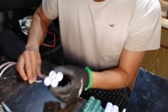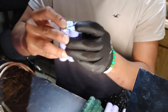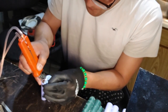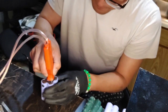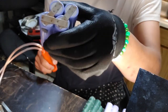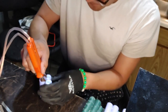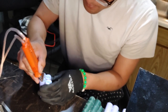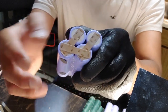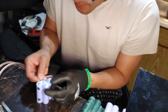Now I'm going to go crossways. When you do the crossway, have it overlap slightly. What I like to do is still have access to the bottom of the battery so I can solder not just to the nickel plate but to the actual battery terminal. I'll start again on the right side and the left side, the left edge, then the left edge of the right one, and also the right edge. I welded it directly onto the battery, not onto the nickel plate. Next, I'm going to do two additional welds on top of the nickel plate. This way, the second nickel plate keeps the first one very, very tight and makes it more secure. You don't want to just spot weld on top, because these spot welds are not that strong.